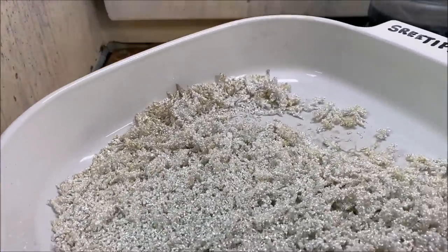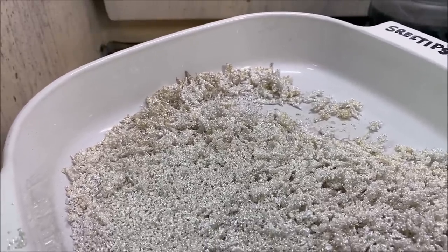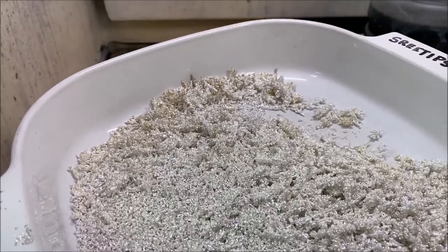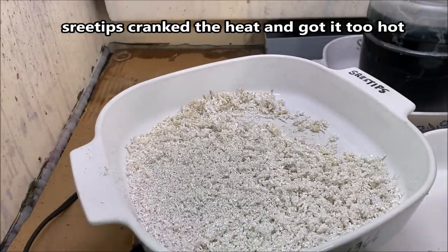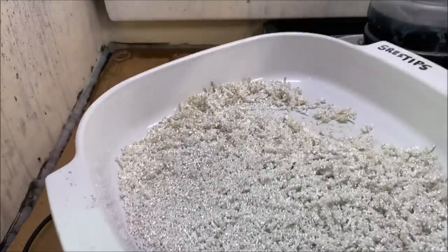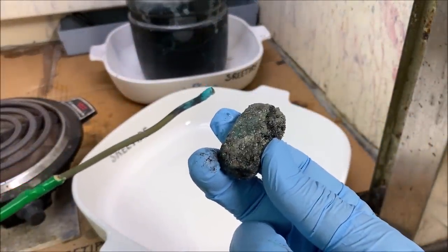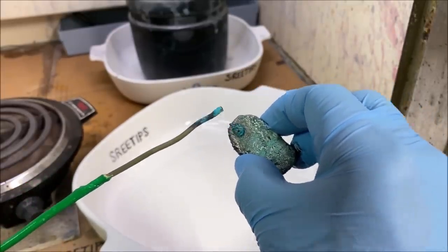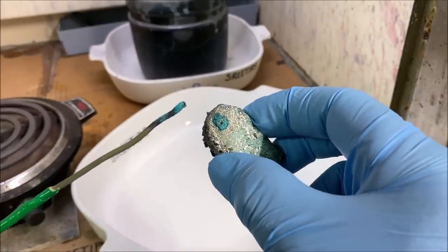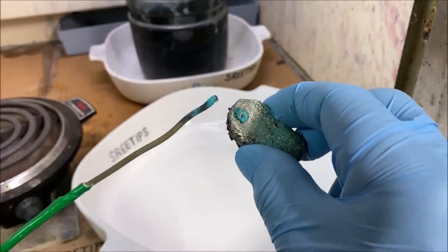About 12 years of refining and I've never had this discoloration happen — of course it happens when I'm trying to record a video. It might be due to some electrolyte still on the silver crystal, or perhaps I rinsed too hastily. Seven rinses should have taken care of it. Now, here's my electrode bar that I've used in my silver cell for probably a year — it finally ate its way through the wire. So we're going to use the 3.3 troy ounces we just weighed out to make a new electrode bar for the silver cell.